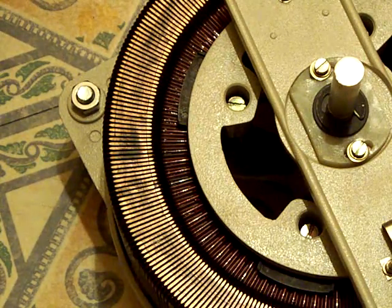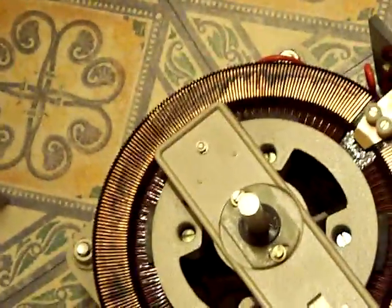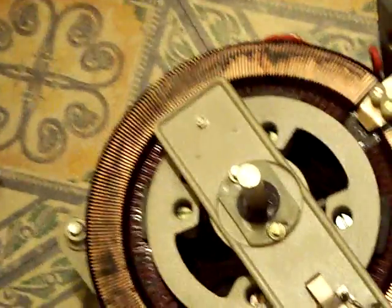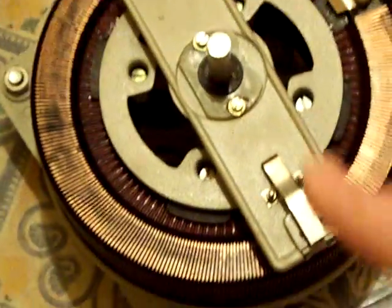Right, let's lower that camera down — no waffle, let's just get in there because time's getting on. It's about 5 to 11 at night. Now the reason why I'm doing this examination so late at night is because I won't be able to do it on camera because it would be dark. What I want to do is power that thing up in the dark with a little flashy light, put the dial on there, turn that up, and see if there's any sparking on that pickup track.